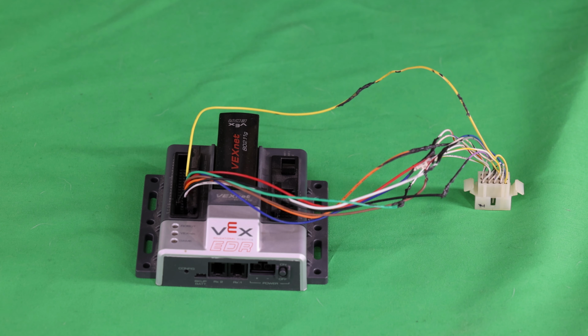I sell a complete upgrade kit that has all the software pre-flashed onto the VEX controller. At this time I don't sell the actual source code. I only sell the pre-programmed VEX Cortexes with the application. And the kit itself, the do-it-yourself kit, requires you to just make the wiring as shown, and then just plug it into the Hero 1 robot once you've assured yourself that it's correct.